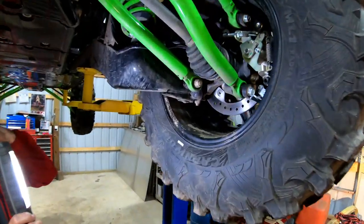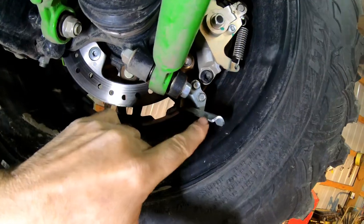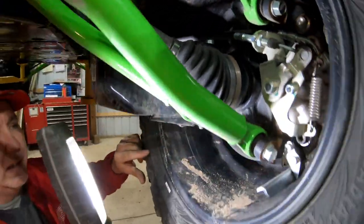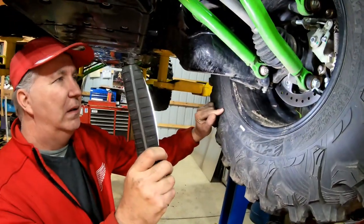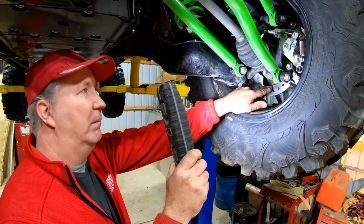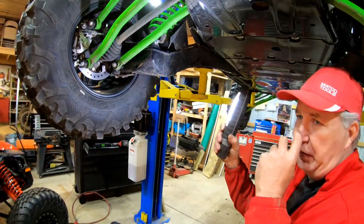Everything's double-sheared on the hub — can't go wrong with double-sheared, that's the best system out there. There are mud scrapers and rock scrapers — two of them — and look how they contour to the wheel. You'll have to get wheel-specific if you change wheels, so if you're going to spend money on rims and tires just verify they'll fit because you might have to pull the scrapers. No grease zerks whatsoever. For a machine under 2,000 pounds, the brakes are more than adequate — they work unbelievably well.